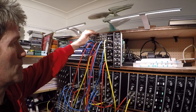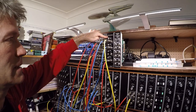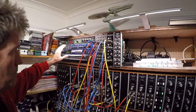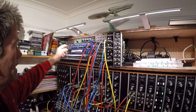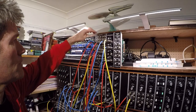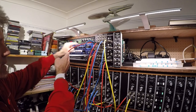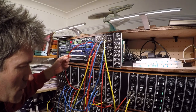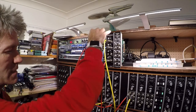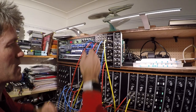The 19-inch rack unit piece is in here, and yes, definitely the anodised aluminium made from the factory looks better than mine. Oh well, I'll have to have another go. I've rigged up the MIDI ins and outs to the 19-inch rack pieces, but I'm not controlling them yet — they do go into each one and back out again so I can use those in the future. At least now I've got the left and right ins and outs, and I've also doubled them. So if I send an input into one, I can just come out of the one next to it instead of making up another cable. Each one is doubled up, so you should be able to get some semi-complex connections going.